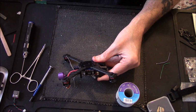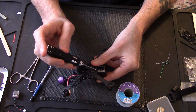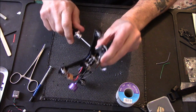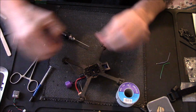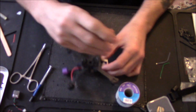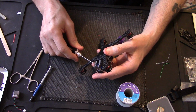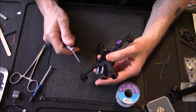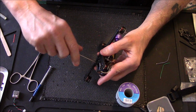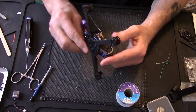Right, screw time. Just a little screw onto the aluminium. Think about that one. Another one on the other side. Remember, when you're screwing into aluminium, you're going to be tempted to tighten up like a madman, right? Because you'll feel it tightening, you'll feel a point where it gets tight, and that's the point when you stop. Like there, I know I could keep tightening that, but because it's aluminium, it will strip the thread, and then you'll be sorry.